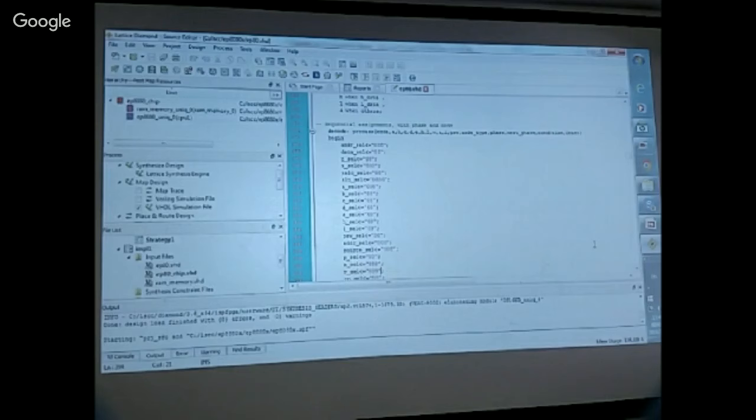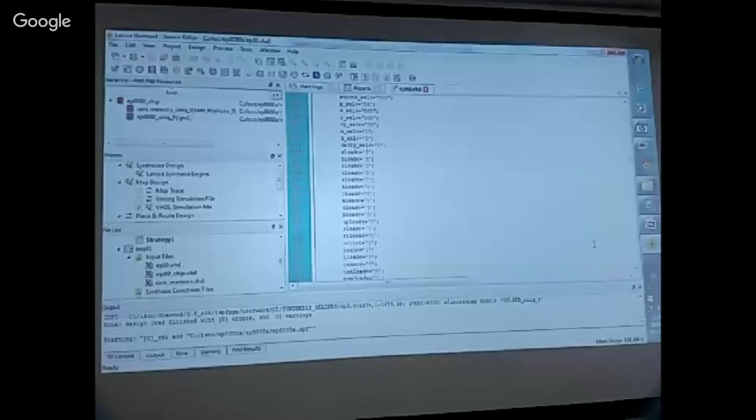And here is the decoder logic. All these selection signals need to be initialized. When you design the multiplexer properly, you put selection zero on the most often used selection. This way, when the decoder is initialized, it always has that configuration, and you only have to change a few of the loading signals, selectors, and multiplexers so that they do the specific things in that particular instruction.